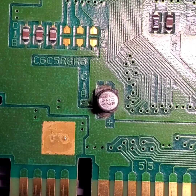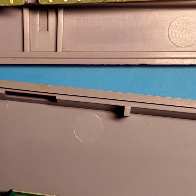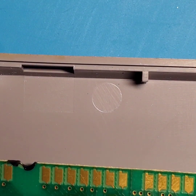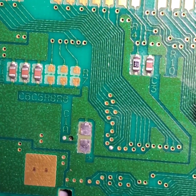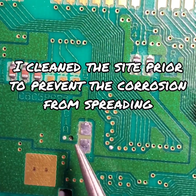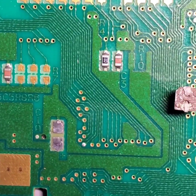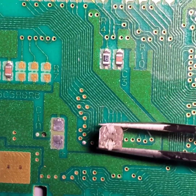Now, when I was actually cleaning this 1.0 game cart that we have, and I'll show it right here, I noticed that this thing had the SMD capacitor running around on the inside. And that's going to be the pad that the SMD capacitor came from. You can kind of tell where a little bit of that solder is corroded and has been eaten away from the electrolytic fluid that came out of this cap.